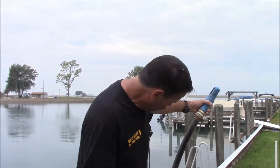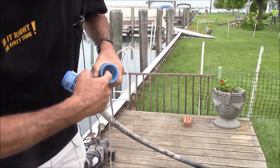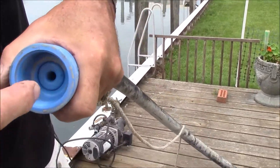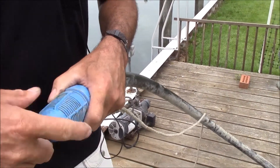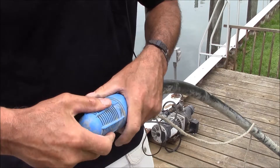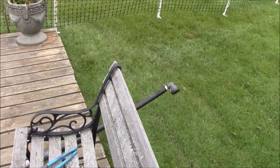What we're doing today is we're going to put the seawall pump in. I'm going to show you a couple of quick things. First of all, this is called the foot valve. This is what's down in the water, and this is a check valve. So what happens is, when this fills with water and our pump gets running, this holds the water in the pump so that the pump doesn't run out of water.